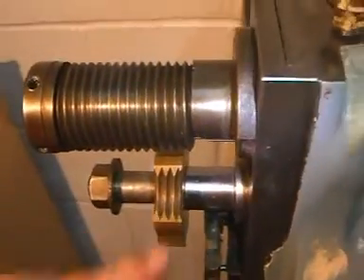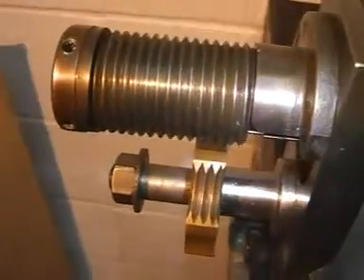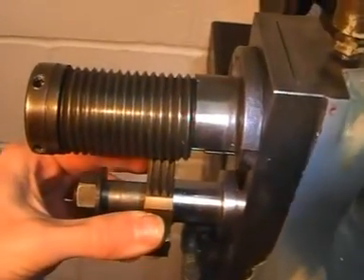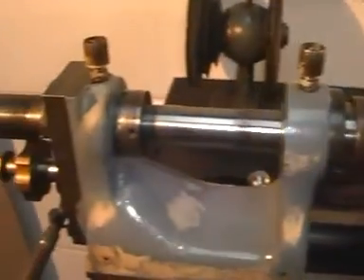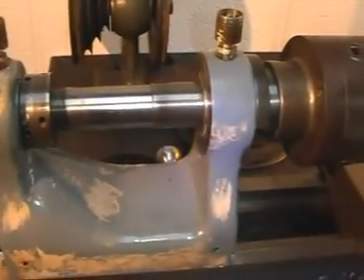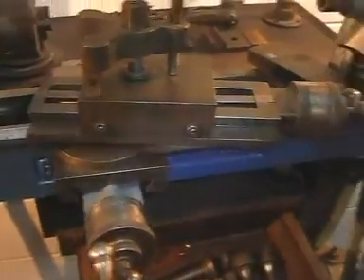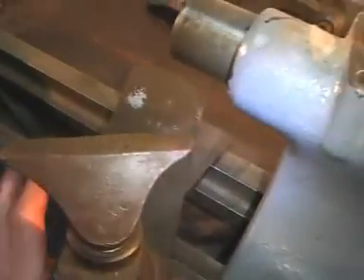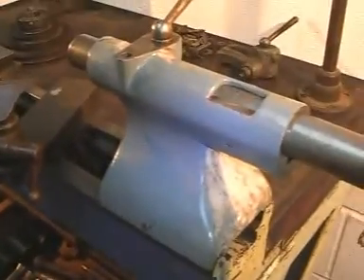This is actually the thread that makes the headstock spindle thread, so you can make back plates or alter chucks to fit, and that fits in place. I believe you'd probably put a spacer there or something to hold that in position and the whole spindle moves. So it's called chase screw cutting — it's a very accurate means of cutting a screw thread. You undo the screw at the bottom and can then position these accordingly, same with the slide there and the tailstock.